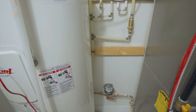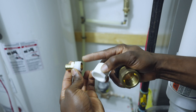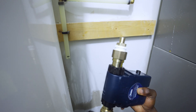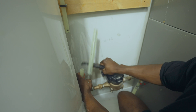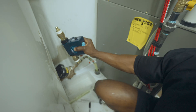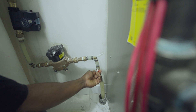Now for the installation. The Flow Shutoff should be installed on your main water line right after the water meter. In my case, I had a 1-inch unit but needed a reducer to fit my 3/4-inch PEX pipe. Make sure to shut off the water before cutting the pipe and use the provided o-rings and grease to ensure a watertight seal. Once installed, slowly turn the water back on and check for leaks.